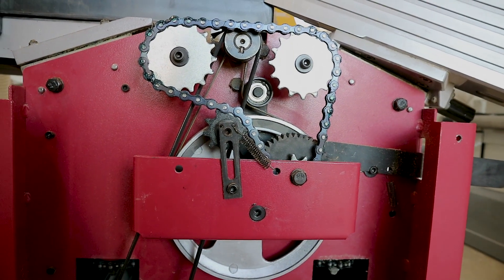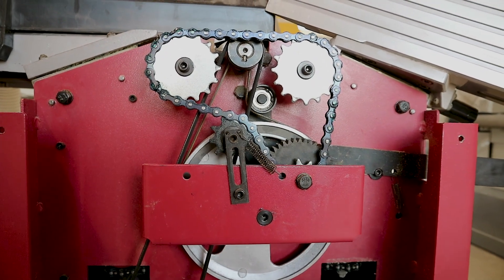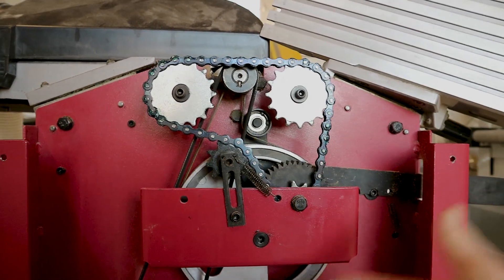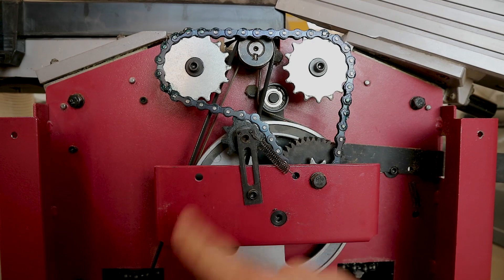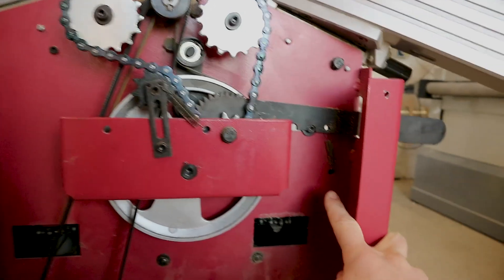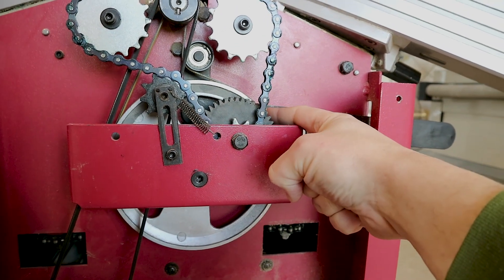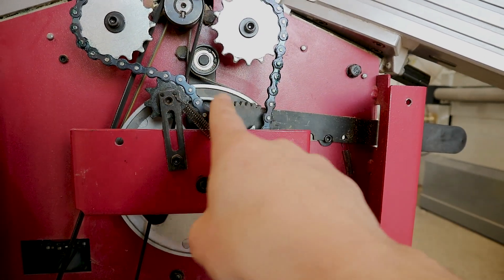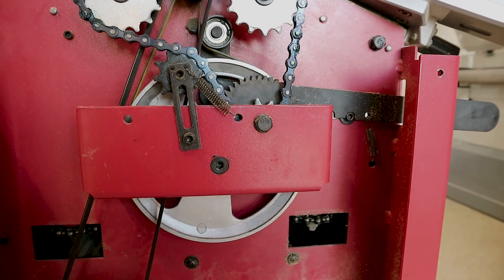So we knew how it should work. With the machine side off — obviously do this at your own risk — we watched it whilst it was running. What was happening was all of this is spinning, everything's working, but the belt isn't moving. One of the things I mentioned in the initial review was that you can adjust the belt tension. If the belt begins to stretch, you can move the adjuster forward or back to get enough tension on the belt. So that's the first thing we did — we tried to move it over, get enough tension — and it sort of worked.